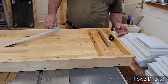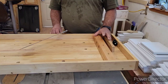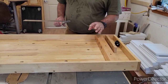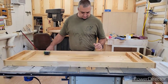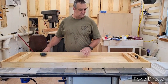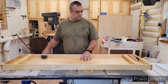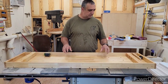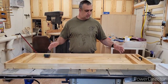This is the bracket for our small little vise. It'll work — it'll be a good little vise — but we're going to take these brackets out and replace them. I'm going to beef up the inside because this tabletop is only less than 3/4 of an inch thick, so we're going to put a piece of 3/4 inch plywood inside here, which will make the tabletop more durable where you can beat on it and add some weight. It's one of the downfalls of this table — it's kind of lightweight. When we put everything back together, we'll make sure everything's nice and square.